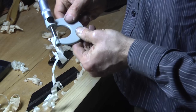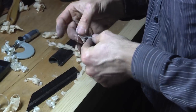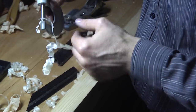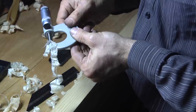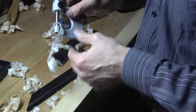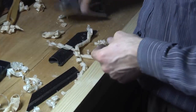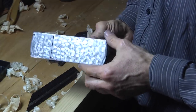Millimeters, so 1/250 of a millimeter, and this is very, very fine. One more try and spruce. Newspaper check also, when I can read newspaper, it's fine enough. This here measures 0.035 millimeters. So with this plane, we can really achieve shavings somewhere between 0.025 and 0.035 millimeters. And that exceeds by far what can be achieved with planes that can be found in stores.